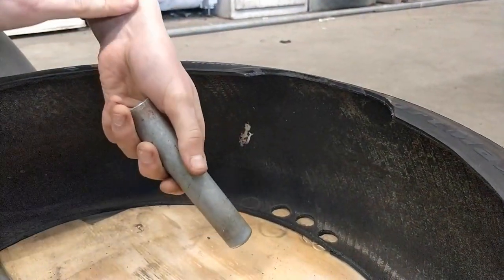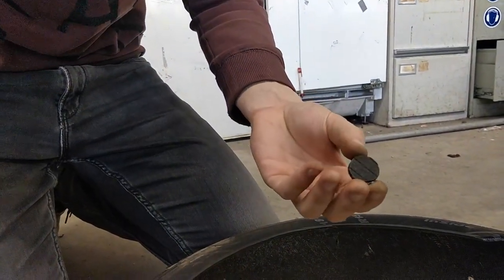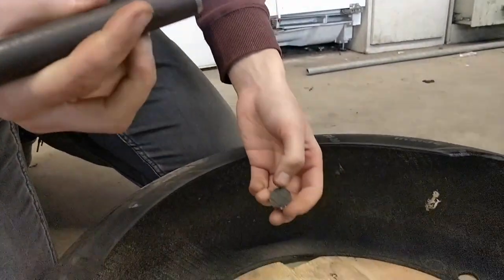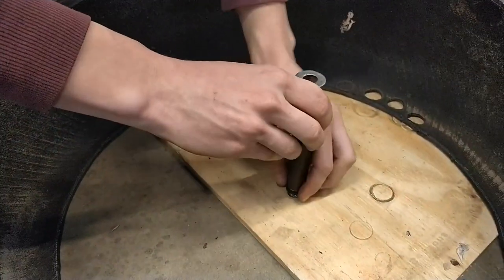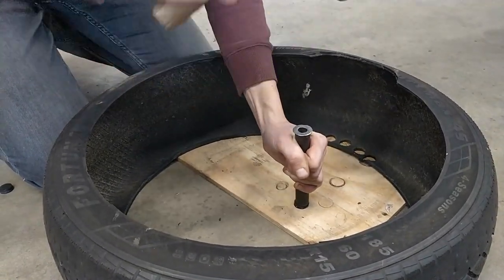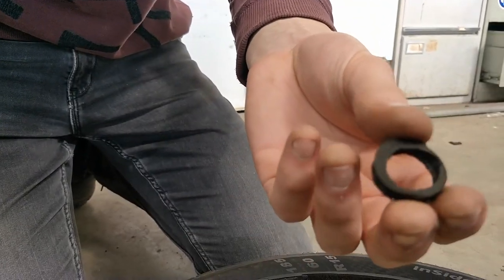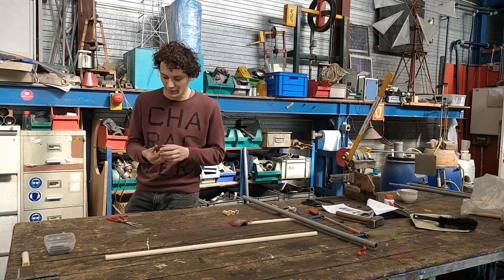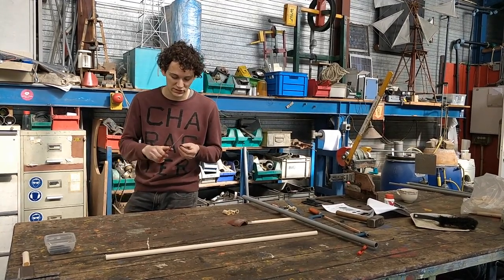Please watch your wrist when you're doing it. We have our small hole right here, and to make it a ring we need a hole in the center as well. We're using a smaller die for this — 16 millimeters. Place it nicely in the center. You can get it out and then this is the ring you're going to be using. Now we punched it out but the edges are quite sharp. We need to make it nice and round, so for that I'll be using scissors.